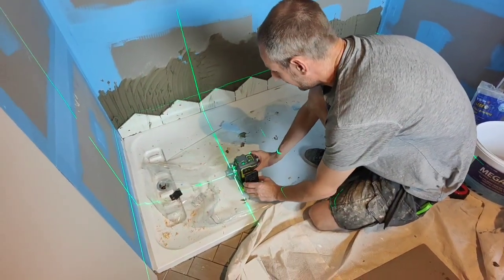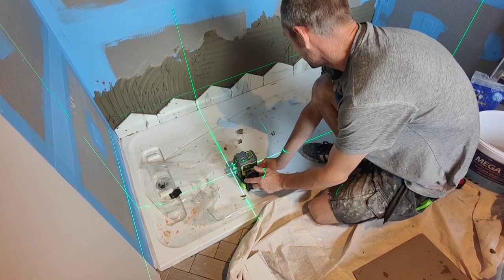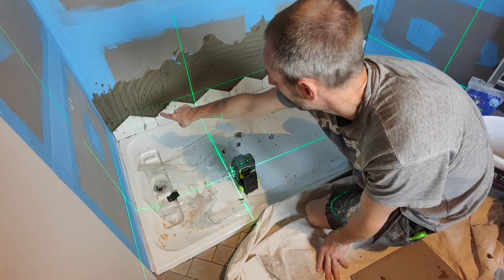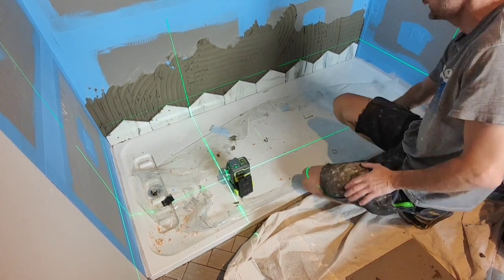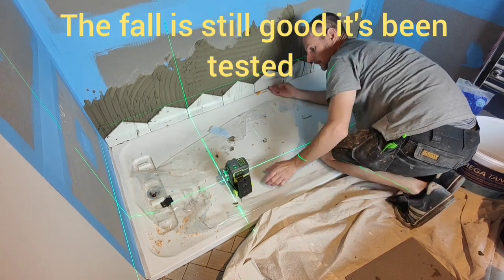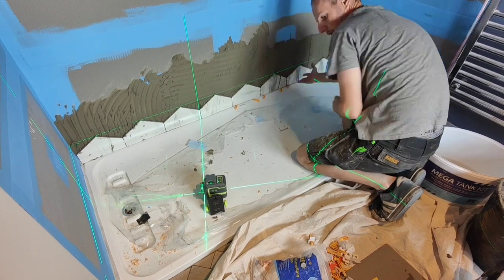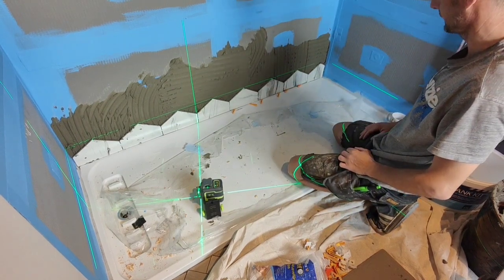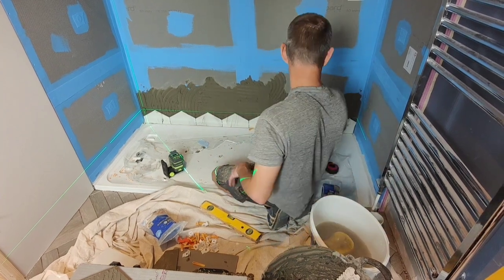I've got them in. I'm using the laser stand on this which is pretty good. I'm just picking the highest one at the minute. It looks like I've got that touching there, that there, that there, that there — and then it drops a lot at this end. I'm going to have to lift them; I may even need to recut them. I'm going to have to recut that one because it's too low, and recut this one here too.